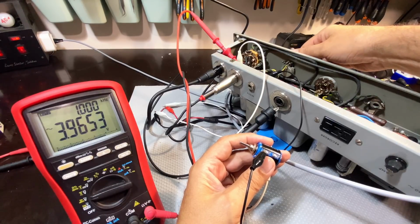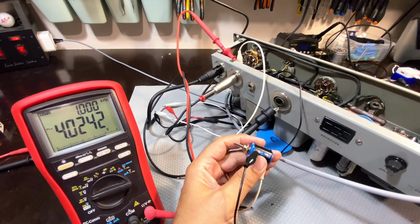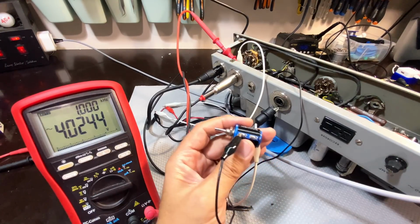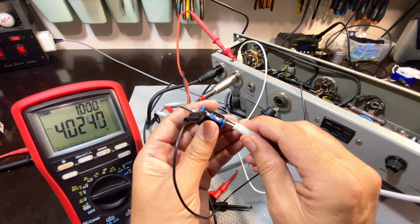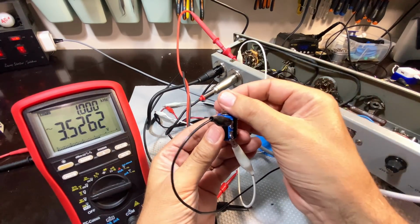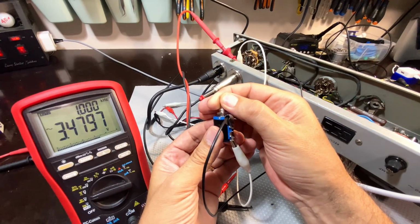And this is only true for 1 kilohertz, remember, because I have to find some reference. Okay, so 4 volts at 1 kilohertz, and I'm now going to put this across there. And I'm going to start dropping that resistance till I get 2 volts on here.